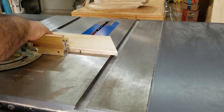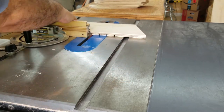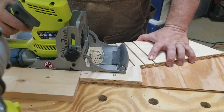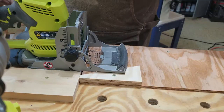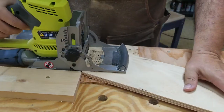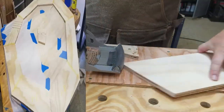I will have a set of drop wires on each level. To run these wires under the track, I make four shallow dado cuts in seven of the segments. To join my segments together I'm using biscuits. Here I'm making the slots in the end of the segments using a biscuit joiner. To make sure all the slots line up, I'm using a makeshift jig. I cut all the slots on one end of the segments and then flip the jig around to cut the slots on the other end.